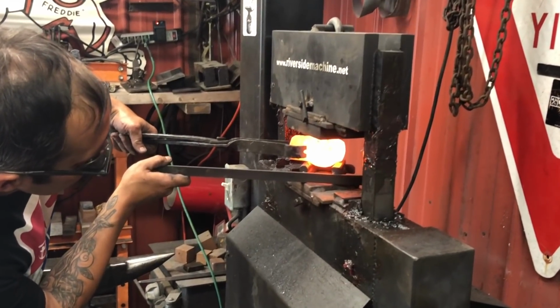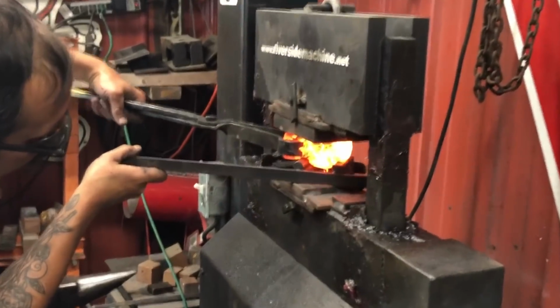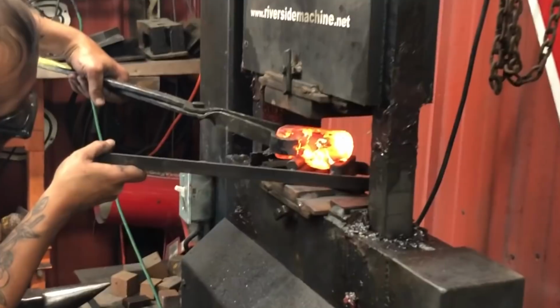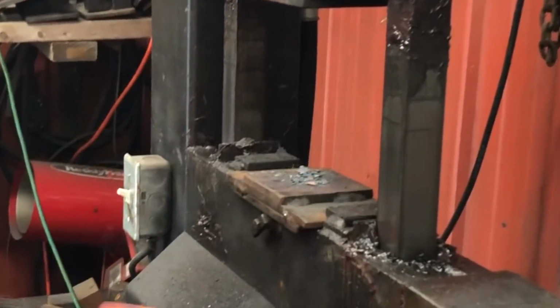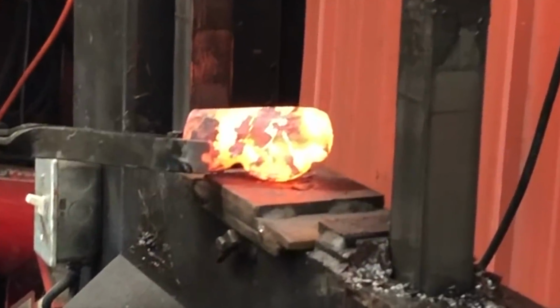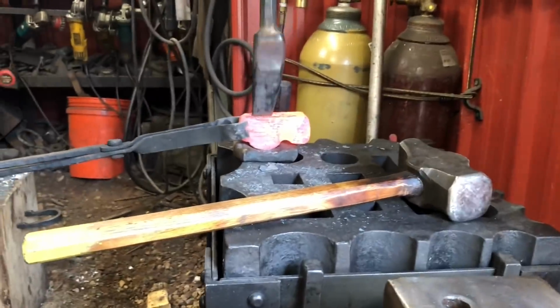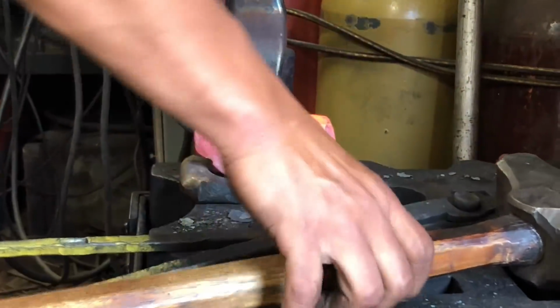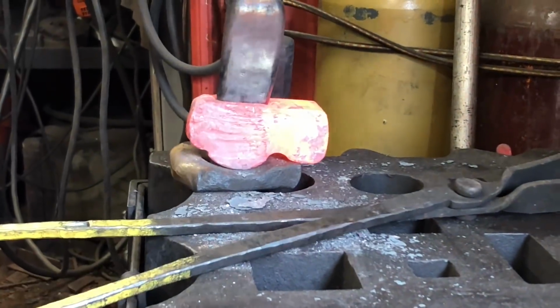Now we're both straightening out the top while at the same time installing a rounded bottom called a cheek. This rounded shape will prevent cracking on the wooden handle. Just make sure I'm taking that hole. This cupping tool will protect the rounded cheeks.